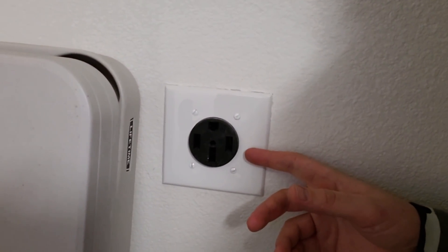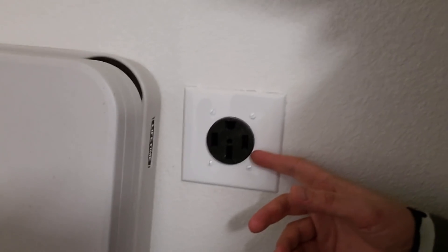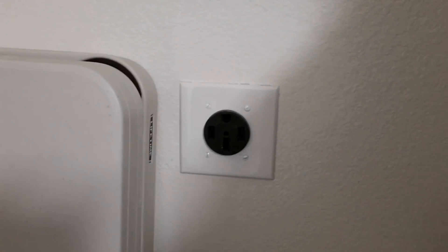Let's take a look at the setup here. There are some interesting things for people with an XC90 T8, especially if you're thinking about getting one and coming from a Tesla. This is a NEMA receptacle — it's either a 6-50 or 14-50. The only difference between the two is a neutral, which you don't really need if you're doing 32 amp. I think it's only if you're doing 50 amp that you need it.